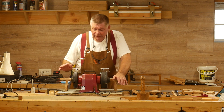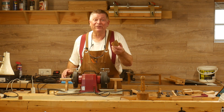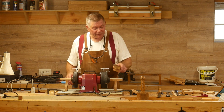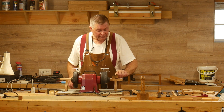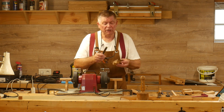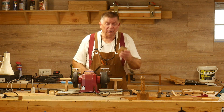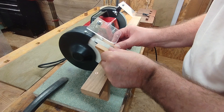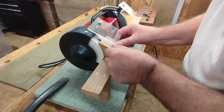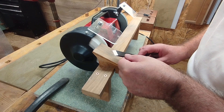This system works by using a series of saddles for doing different jobs. I only made this one the other day and it already looks 10 years old — they get very scruffy very quickly. But this runs along the front of the machine on the rail like that, and there's a little lip for guidance, and this presents my chisel to the stone at 25 degrees every single time. It's very consistent, so this is ideal for chisels and bench irons — anything you want to grind at 25 degrees. I can move backwards and forwards and get a very consistent grind.